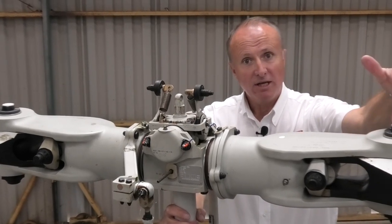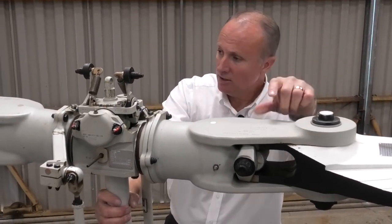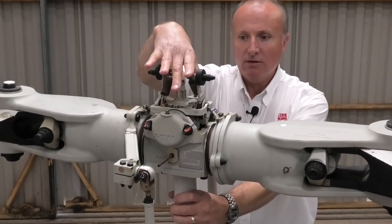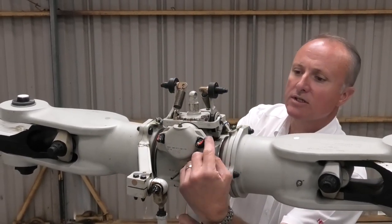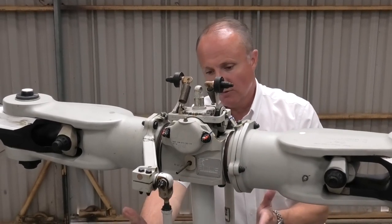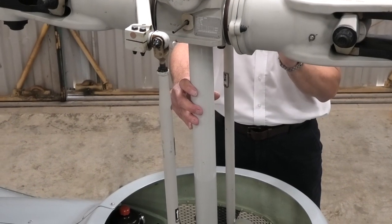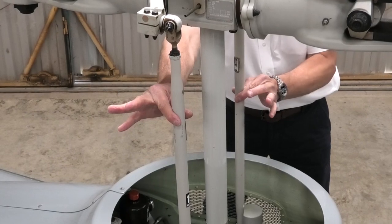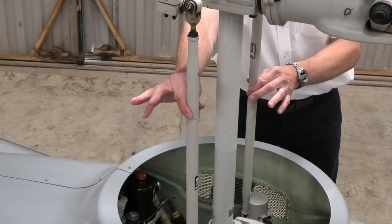When we're happy with those, we check the blade bolts on both sides. We check the latch bolts on both sides. We check the general condition of the grips, which look fine. We check the yoke and the trunnion, and the retaining bolts — all the witness marks are good as you can see. When we're happy with the general condition of the head we move to the pitch links to check for wear. When you check for wear you want to do slow, small movements — it's no good pulling things around; you'll feel more if you're very delicate. This aircraft is relatively brand new so we wouldn't expect to find any wear at the moment.